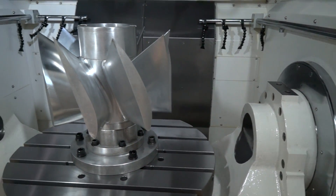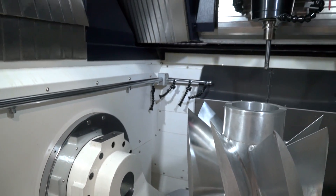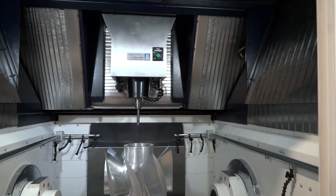What does that give the machine? It increases the surface of the connected parts — the moving part and the machine bed — and we want to have a high surface to lead the vibrations into the machine bed, which absorbs them. Because the machine bed is 21 tons, it dissipates vibration into the machine casting, so you get less vibration in operation. You can see it in the tool lifetime — it's increased — and the surface quality is better with less vibrations.